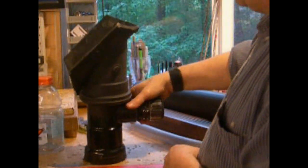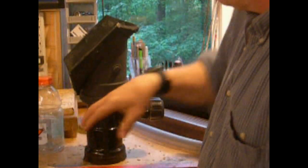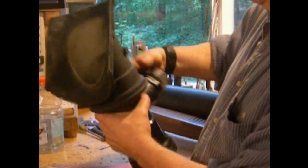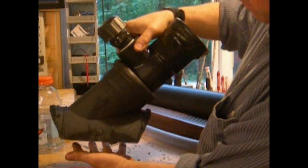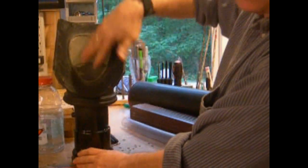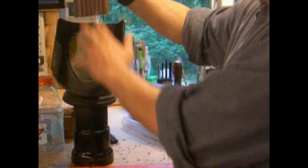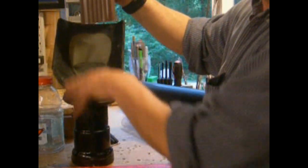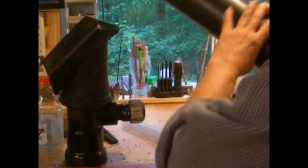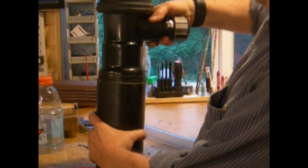This is my first part — just a piece of PVC, just a T. I bought this at the local ReStore around here, and this is actually two pieces. I found this piece the other day; it's actually a splice in it. If they put on a bigger pipe, you'd splice another one into it, but it worked good because it has this nice angle on it. I put the heavy duty screen up here, and what happens is that'll be outside your gutter. You put your gutter like that so the rainwater will come in. Any debris and stuff will fall in here and then it should be washed off with the water flowing down. I just hook a hose into there, and this is where you collect the dirty water.